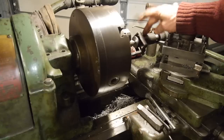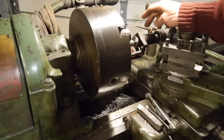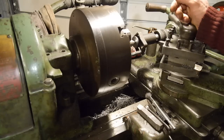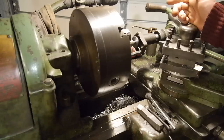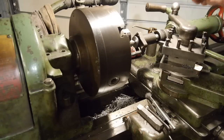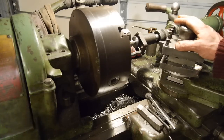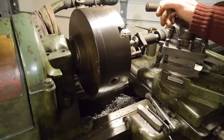On the way there I've got to make a milling cutter to cut the gear. I'm going to make it out of this piece of stock - it may be carbon steel. It's just scrap yard steel, I'd be lying if I said I know what it was. It had a key cut in it so my guess is it's some kind of shaft with low alloy or carbon in it. I could cut off a little piece and forge it to test it, but I'm not going to do that. Maybe I'll find out when I try to harden it, or maybe it'll be junk.